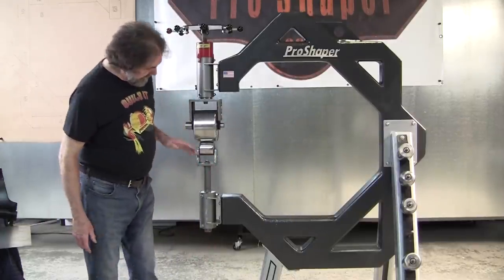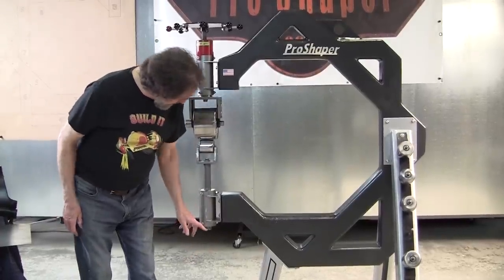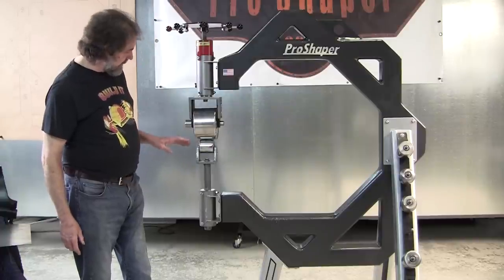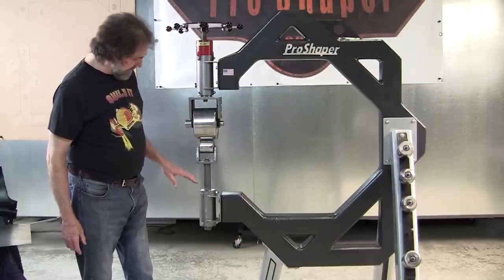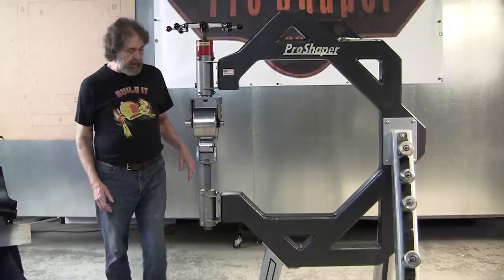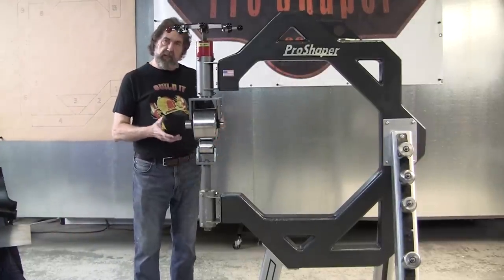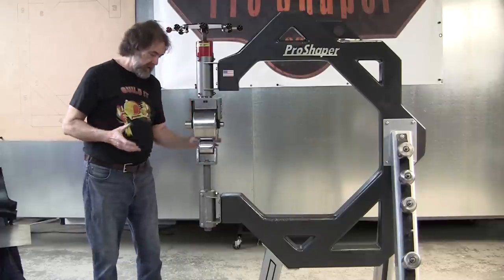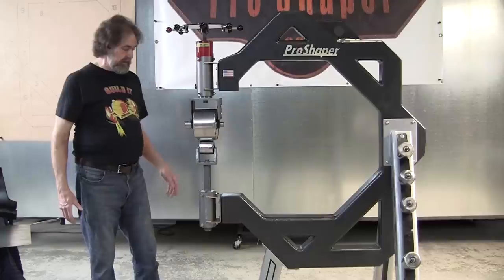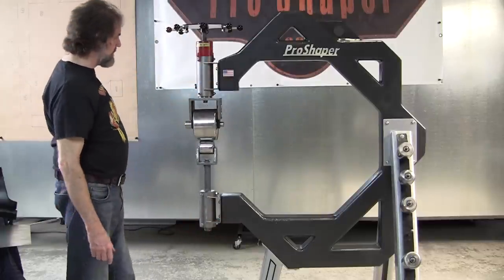Now this one, it has clearance underneath the bottom anvil, but it's probably about 16 inches or 18 inches here. You can modify that a little bit if you wanted to, but that's adequate, that'll work. And where that comes into play is when you work a panel out of arrangement, they go into a curl arrangement, and it'll come down like this, and you have to go underneath that lower anvil. And then having that clearance under here makes a big difference.